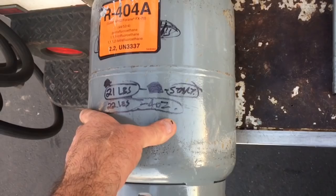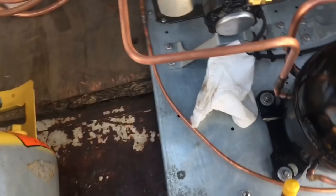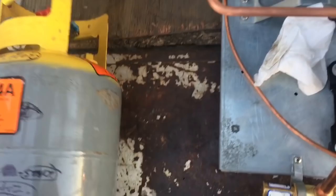Actually, I think I had a leak when I had an access T right here before, and it looked like it was just starting to leak a little bit. I pretty much know you got a good system when you recover 90% of the charge out. Okay, thanks for watching. All right, bye.